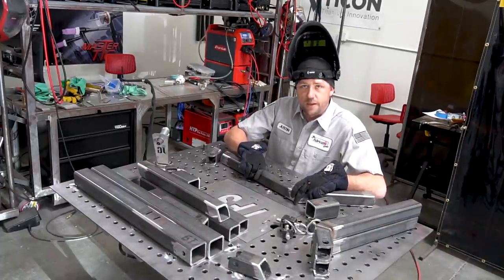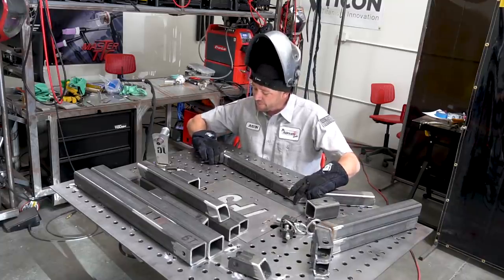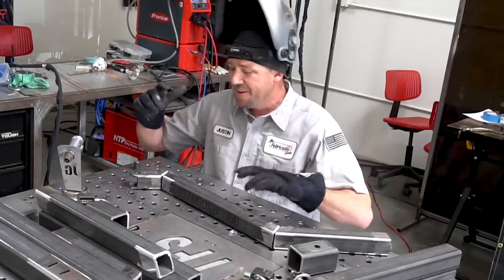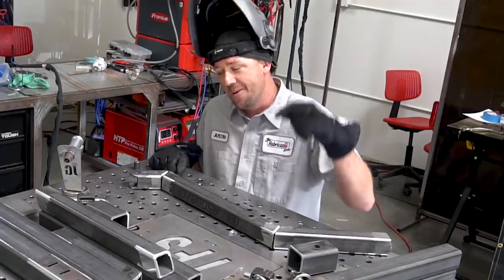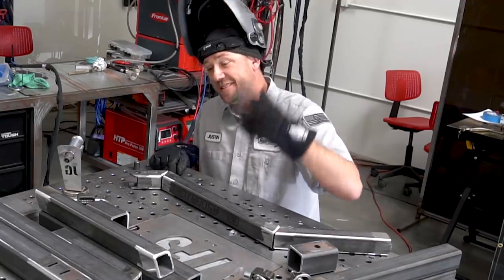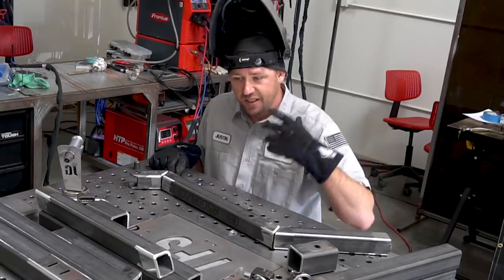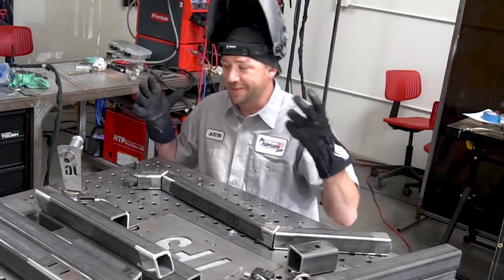So I was getting a little ahead of myself there, primarily because I wanted to find out whether I was gonna MIG or TIG weld these. The answer is MIG. Now the reason why: when you cut a reactive metal, or just about any metal for that matter, with something that's not a shielding gas, like in this case, these were cut with oxygen to drive the price down instead of nitrogen. Nitrogen would have shielded it and left it very clean, ready to be welded with a TIG, for example. But since these were done with oxygen, gotta use the MIG.